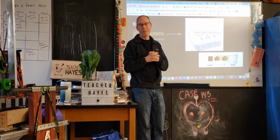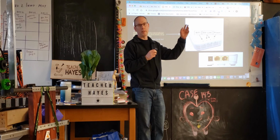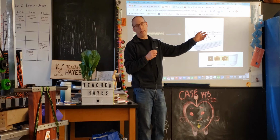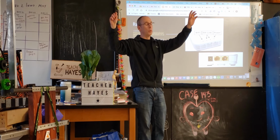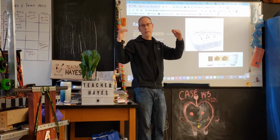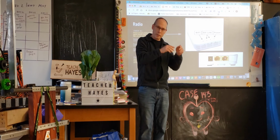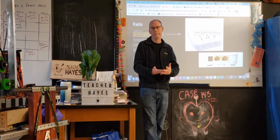So it doesn't go through the radio to get to the RoboRio, it just goes directly to the RoboRio, basically? It doesn't go directly, but parts of the protocol stack are being terminated by the radio, and the information that you're sending from the FRC driver station is not stopped at the radio. So it goes all the way to LabVIEW. At one level, the application in the RoboRio is sending data all the way to our computer. Two layers down, it puts it in some packets. Another layer down, it goes into a frame that terminates, but the payload stays the same across those. So it's just the network protocol stack.